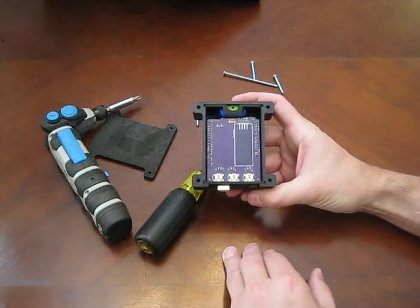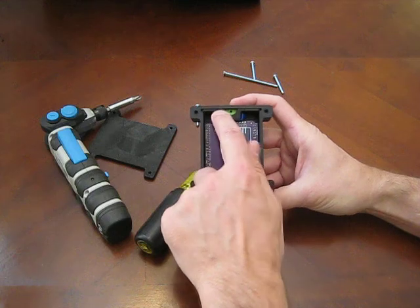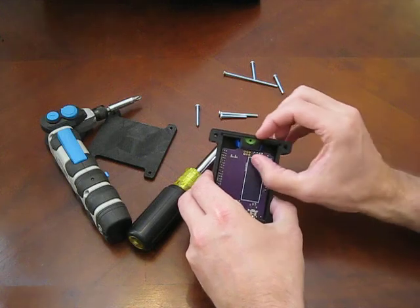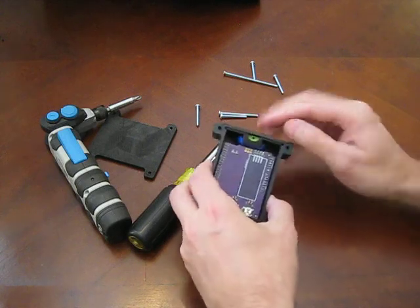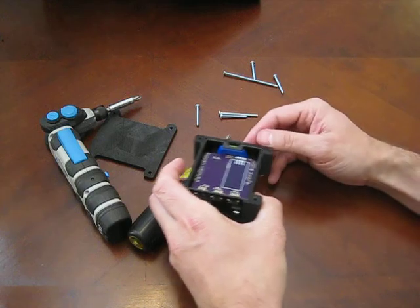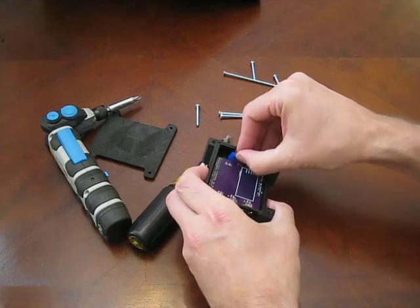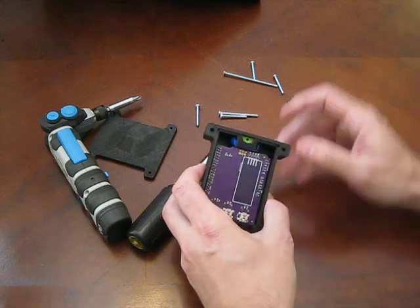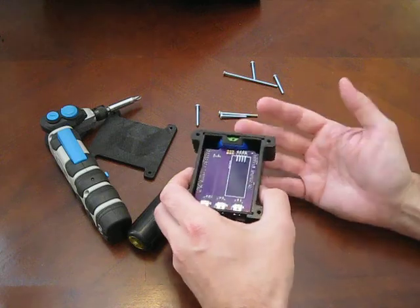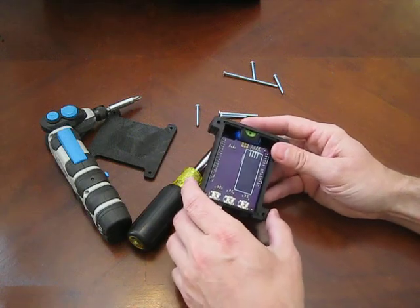Now, since this is open, let's talk about the inside of this box. We have a plate here that slides into notches here, and another set of notches back here which has my adjuster. It's a little bit too short so that this thing can slide in quite easily, or you can add little pieces of electrical tape here. I had black tape in here, but it was so nice with the black that you couldn't even see it. It adds a little bit of flexibility through the wedge that goes in there, and the electrical tape is used in case there's a little solder sitting out so it doesn't short out.